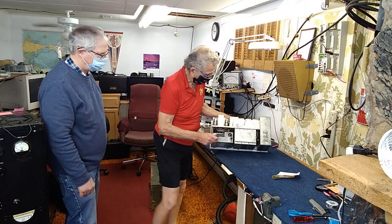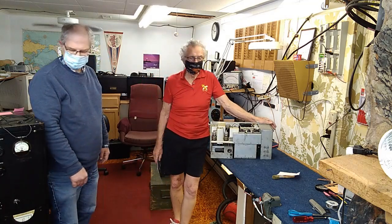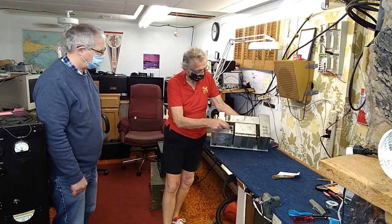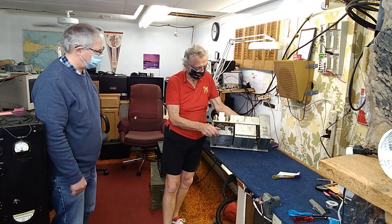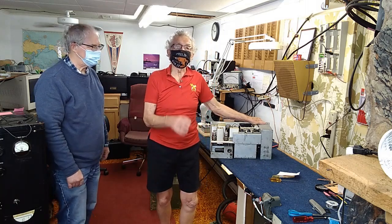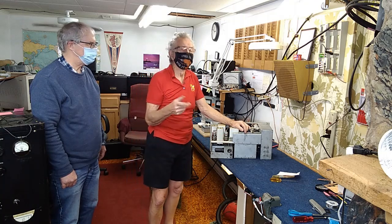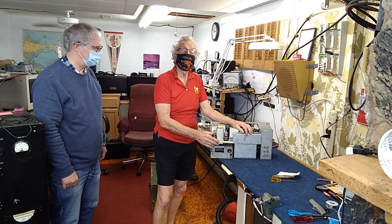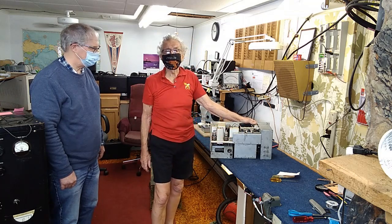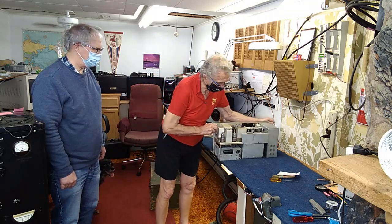These sets came either with a 110-volt power supply and a rectifier, as this one, or the BC348 came with a 24-volt dynamotor that replaced this. This power supply screws in here, and it could be removed and a dynamotor circuit installed here, and you'd have a BC348. The dynamotor was a little motor generator about that size. It ran on the 12-volt DC airplane power, or 24 volts rather. Some were 36 volts. In that was divided the 6 volts for the tube filaments, and it generated 250 volts DC for the power. These tubes run on 250 volts DC. So that's it.